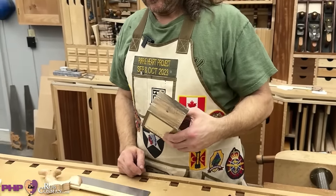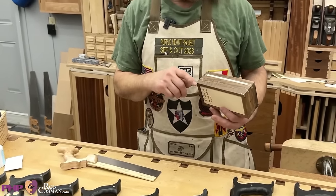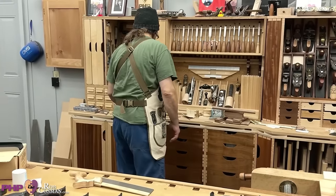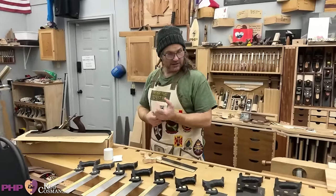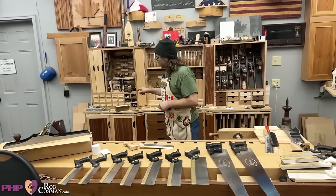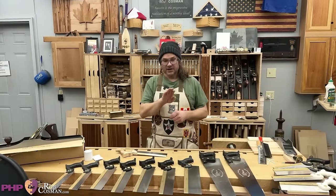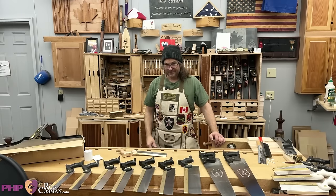And if you want, you can set up your router and literally just turn the end of the dowel against the spinning quarter inch or eighth inch diameter router bit. But then to get it close, I sanded it. I put the piece of dowel into an electric drill, and then used the sandpaper to shape it, and then have another piece of wood that you've stopped the router bit in so that you could actually then go in and check it to get it to fit. I've also done the lathe before, stuck it in the end of a Jacob's chuck and just come in there and turned it, but then you still end up shaping it with sandpaper to get it perfect. It's not that difficult. You just have to guess.